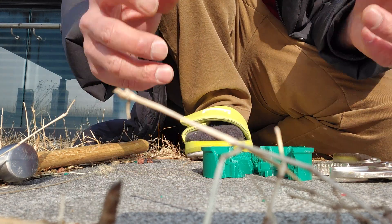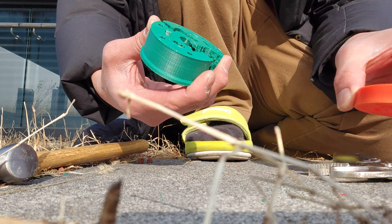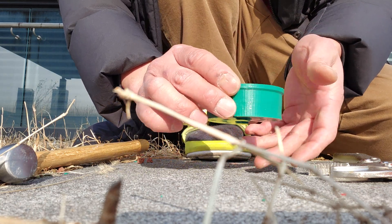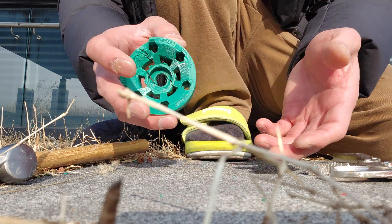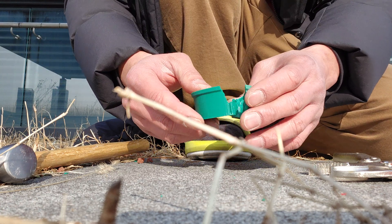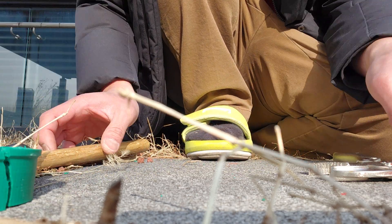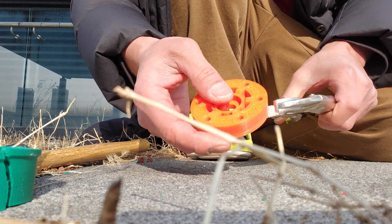For my purposes, the tensile strength is supposed to be stronger on the PETG, and we're gradually increasing the strength. But I also need it for impact resistance because this is going to go on the electric skateboard to handle sudden impacts. I need this thing to not crack. So Prusament PETG, dried filament — it cracked.